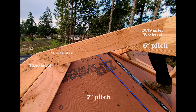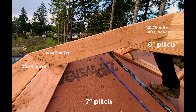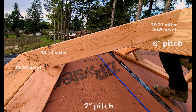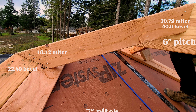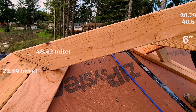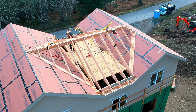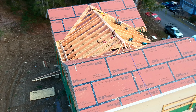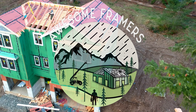I got smart this time and took a picture and labeled the angles, because it's an irregular roof. We have a broken hip that lands from a 6/12 intersecting with the 7/12. The miter and bevel up at the ridge is easy to calculate — I just use Build Calc now; used to do it longhand but my brain isn't as elastic as it used to be. The miter and bevel at the bottom, however, is a different animal: the saw setting for the bevel is the same as the backing angle for that irregular roof on the 7/12 side, and the miter is your level cut times two subtracted from 90. There is the roof — all skeleton is framed, ready to be sheeted. Thank you guys for following along, please like and subscribe.